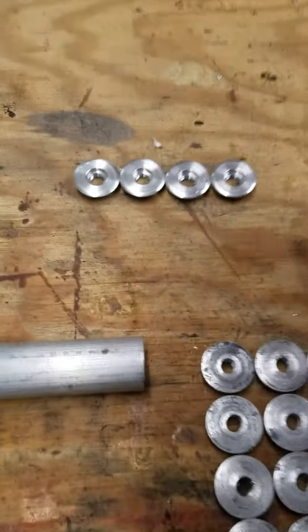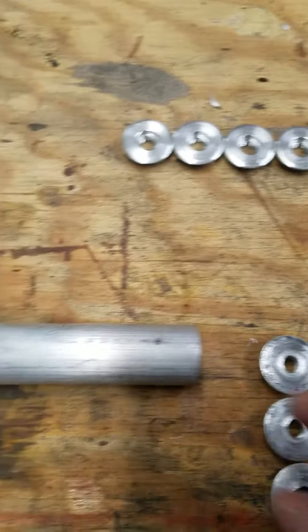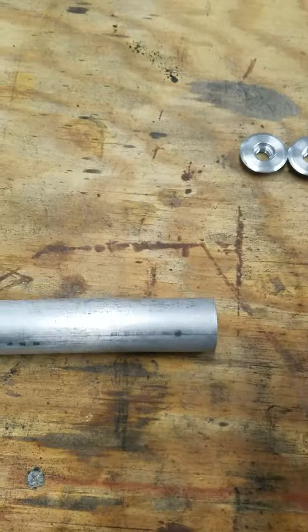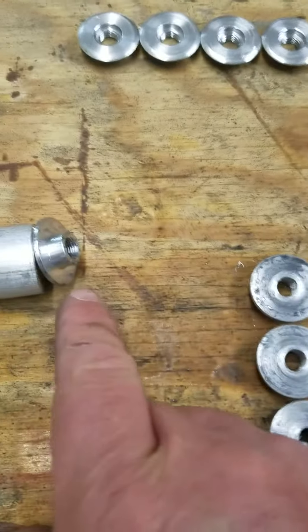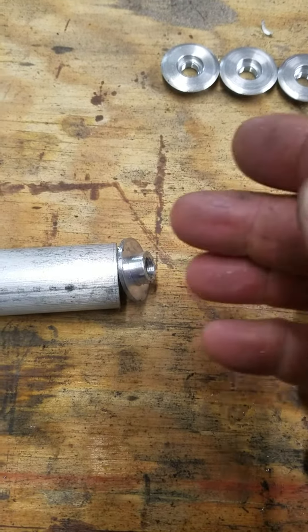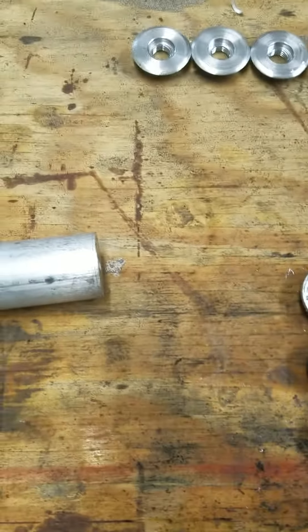This is the ring portion of the McFueler. To make it, I take a piece of 1-1/8 inch stock aluminum 6061 and turn the end down to 9/16ths, quarter inch back, then drill it, tap it, and cut it off with the parting tool. That leaves these parts.